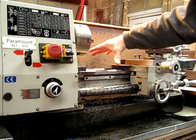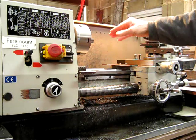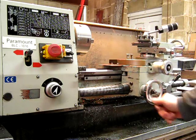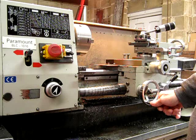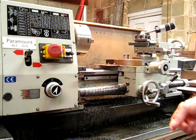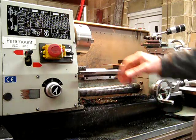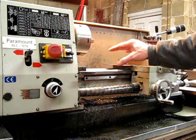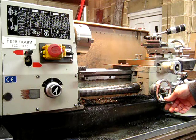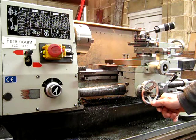The bed: obviously the wider the bed, the more rigid the lathe will generally be. A narrow-gutted lathe — the accuracy isn't going to be as good because you've got more chance of tilting on the carriage. This one's about five and a half inches wide, double prismatic. Most of the Asian lathes use prismatic ways on their beds, and they hold tolerances extremely well. They're not all hardened — depends on the model. Hardened is better obviously, but this one isn't hardened and it's done a massive amount of work and it's still as good as gold, provided you oil them and keep them clean. So I wouldn't get too concerned about the fact that the ways aren't hardened.